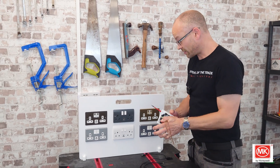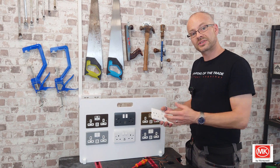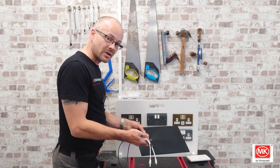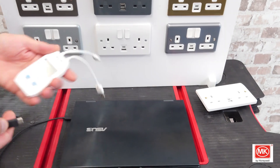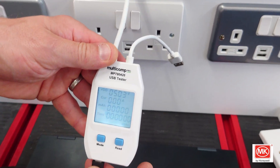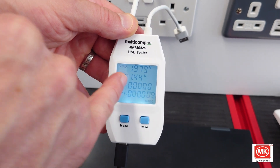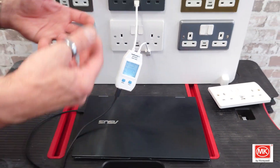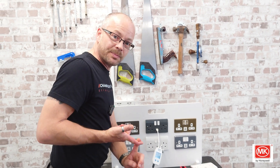So what else can I say about the socket? Well, I think it's time that I plugged a few things in, and we'll just see how much juice we can get into various different devices within 30 minutes. I'm not actually going to time how long it takes to charge this laptop up, but I just wanted to demonstrate how much power it will actually draw. With my USB tester plugged in, straight away we are drawing just shy of 20 volts maximum that the socket will allow, with a current of 1.44 amps. I've also got a tablet and a mobile phone to try.